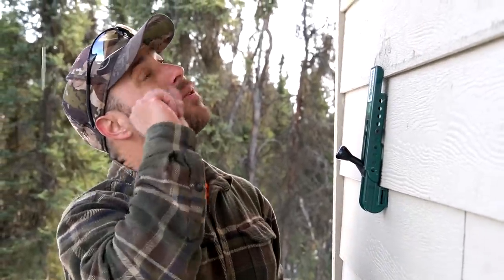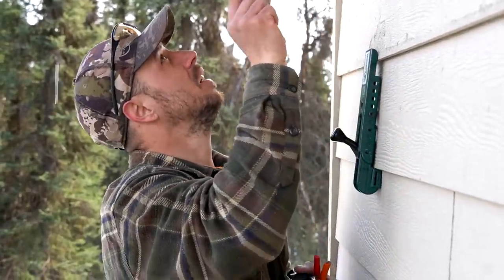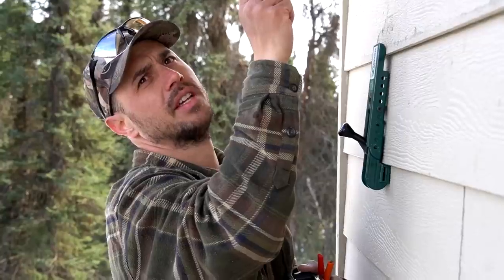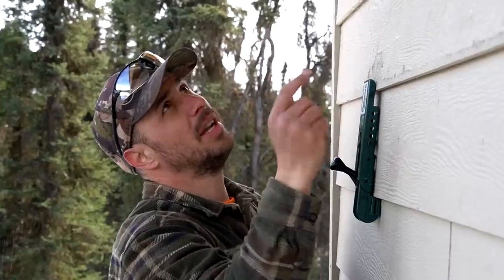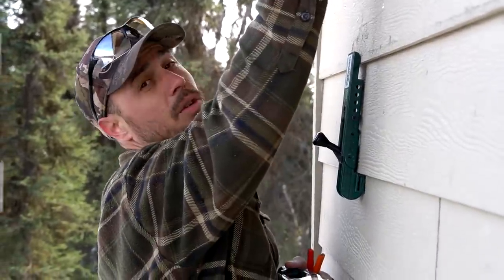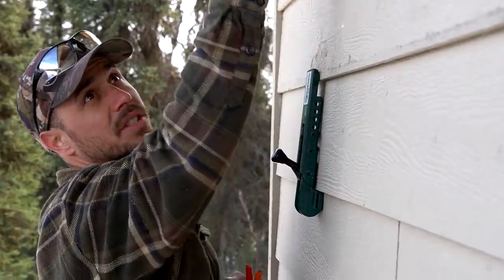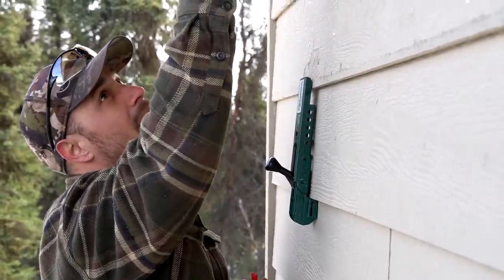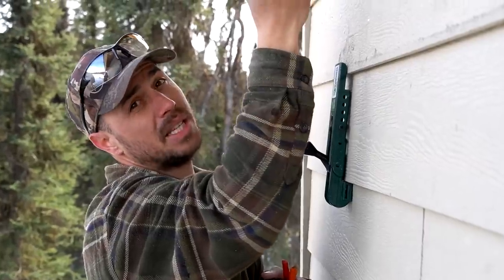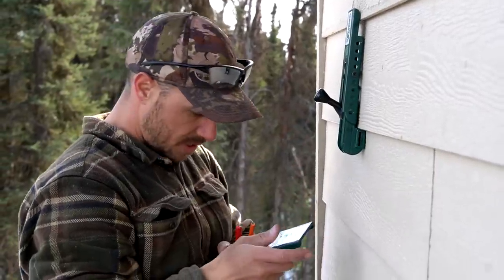We're getting up to the part I've kind of dreaded all day — the rafters. We don't have a soffit enclosed, so it just goes straight into the rafters, and we're going to have to notch one of these pieces of siding on every single one. There are about eight to ten to notch. We've decided to change from a seven inch reveal to a six inch reveal as we get closer to those rafters, so we have a big enough piece to actually notch out. This one is already set at a six inch reveal.